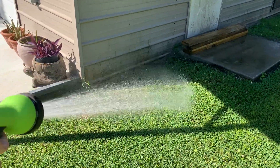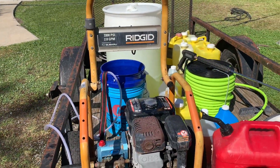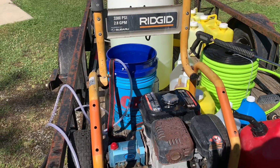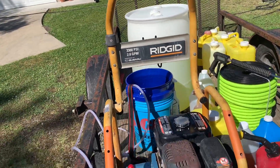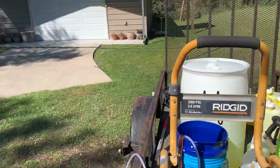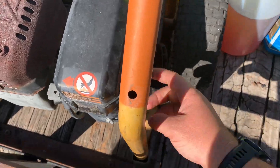The first thing I'm going to try before using my 12-volt pump is to downstream it. I've got 10.5% bleach in that jug, so when it downstreams it'll come out to about 2.1% on the metal roof. I'll try this first and if it doesn't work I'll need a stronger mix and use my pump. I'm going to pre-wet the roof a little bit and then get started.